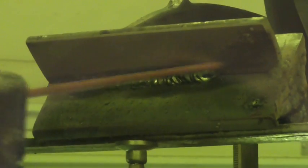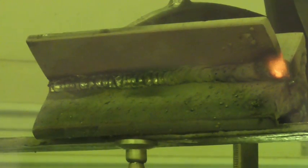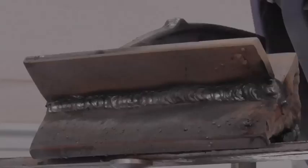There's the termination of this part of the weld — I just ran out of welding rod. I light up well ahead of the termination and drag the electrode while long arcing back to the termination. The reason is that a second or two of dragging back and long arcing heats up the electrode so that when you arrive at the termination, you'll have good fusion and penetration without a lump at your restart. At the termination of my weld I'm hitting once, twice, three, four, five, even six times, to get weld bead all the way to the very end so we don't drop off with nothing.